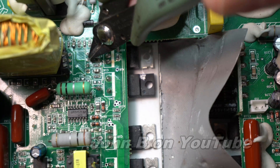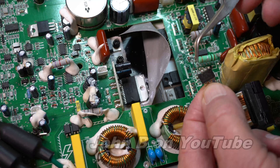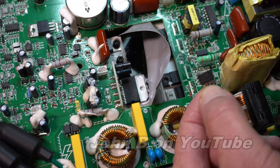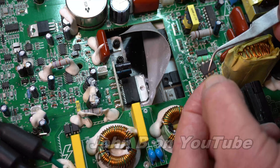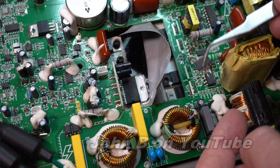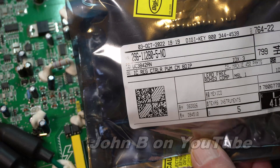The through-plating connects the top-side tracks to the bottom. I've changed this chip: I cut the legs off, pulled four legs out with tweezers and the soldering iron, then turned the board over and ran the soldering iron down all four legs, heated them all up, and pulled the remaining chip out. This is the part number for the new one — I got it from DigiKey.